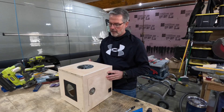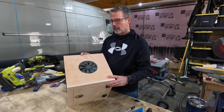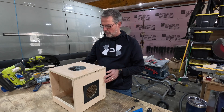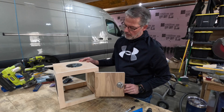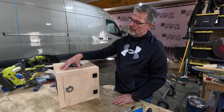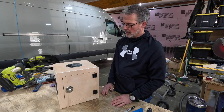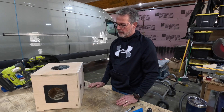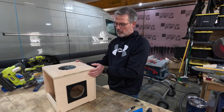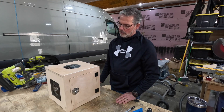Here's the completed test box with the inset panel in place — there's a cutout for a fan in the top for the electrical cabinet exterior vent, a vent for the side of the electrical cabinet, and the door with hinges and a latch. This all came together really well. This is just cheap plywood — I didn't want to waste Baltic birch on a test cabinet, so it'll look a lot smoother in the end. But this proves out all the components I want to get into the cabinets in the van. The mortise and tenon joints work really well, are very easy to put together with the pocket screws, and turned out nice and sturdy.